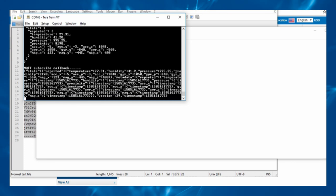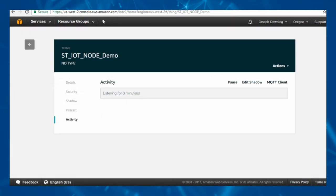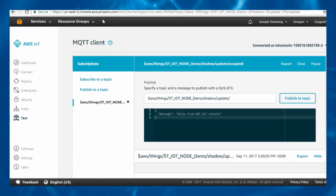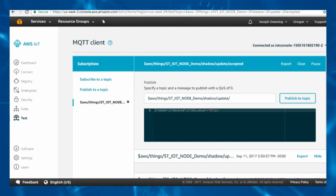To view the connectivity, select the AWS console on your browser. Select Registry, then Things, and then select Your Thing. Click on Activity and you will see a graph showing the connection rates. To interact with your thing, select the MQTT client. Under the Publish window, input the command shown on the screen or found in the setup document. In the JSON window below, copy the statement on the screen or in the setup document. Click the Publish to Topic button and watch your board's LED turn on. To turn off, go to the Publish window and repeat the previous instructions, changing the word 'on' to 'off'. Your IoT solution is now live.